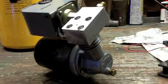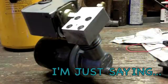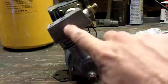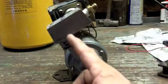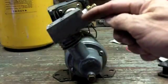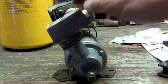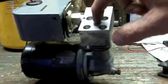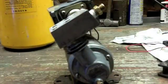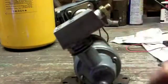I thought about drilling the intake hole bigger to put a little velocity stack with an air filter, but I don't want to screw this head up at this point. Cutting decent cooling grooves isn't feasible without a controlled cutting device like a mill, because the exhaust port comes up about halfway and then shoots across. The original hole is about a quarter inch, and these holes ended up being seven-sixteenths of an inch. I've got a rotary cutoff saw with a non-ferrous metal blade, but that's a circular-saw-type deal — so I'm scrapping that idea.